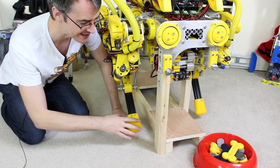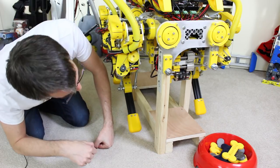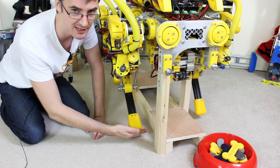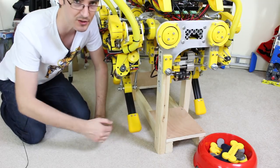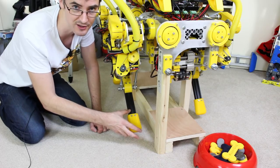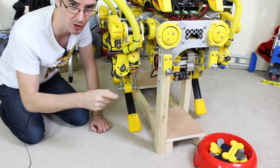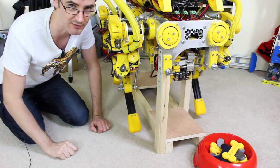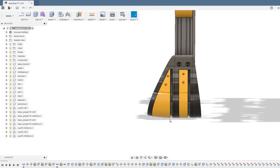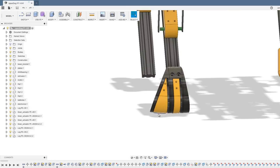The plan is to reposture the legs and the feet so the feet are closer together, and therefore the gravitational effect of lifting one foot off the ground and it falling over is far less, which will make it easier to be dynamically stable. The current feet have quite square edges, so I'm going to make ones with much smoother curves. I also want to allow foot pressure sensors so I can sense when they're on the ground, and they'll be slightly flexible — you can either put a hall effect sensor and a magnet, or a force-sensitive resistor in there.